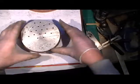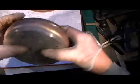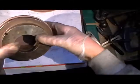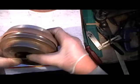Then I've put this other block on top just to clamp it all together, and as you can see I've started to already flange this one. It's ready for annealing again, but I'm probably 80% over with this now, so I've just got that little bit more to do on that.